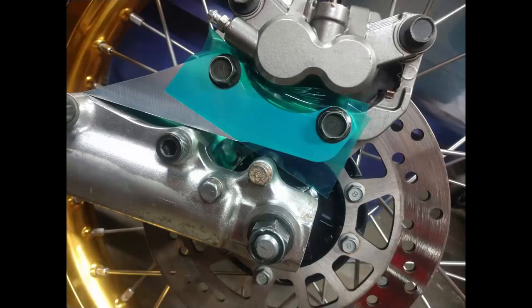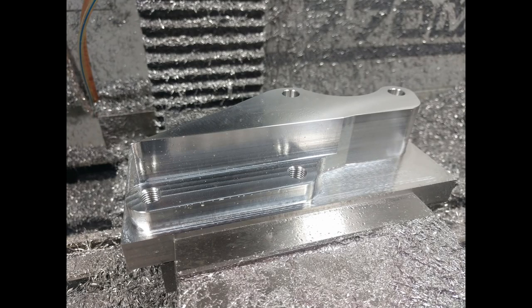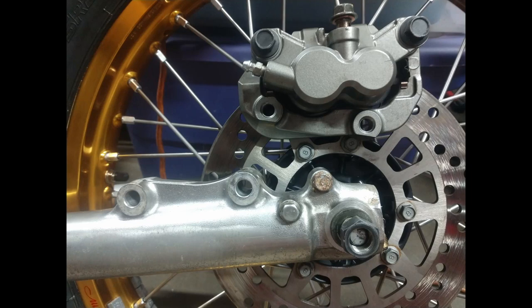So luckily I stopped it and checked it, and it fit perfect. I love the fit of it. So I just ran the pass one time, and then I just ran it in the other hole. As of now, I think I've got thread milling down. I've worked on it pretty hard. I ran a couple different threads. I only have one or two thread mills and they're used. So I just tried to be very cautious when I was trying to learn so I didn't break it.